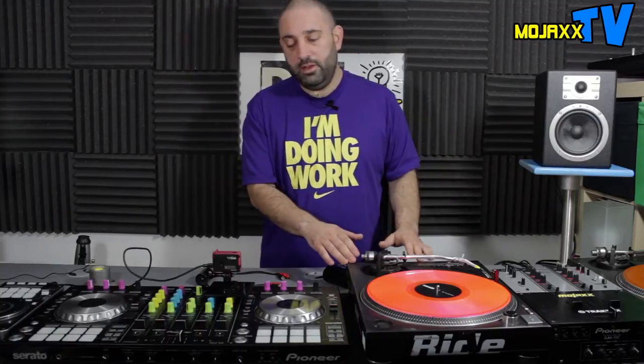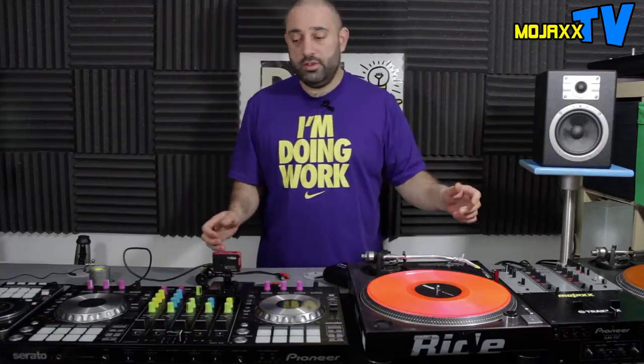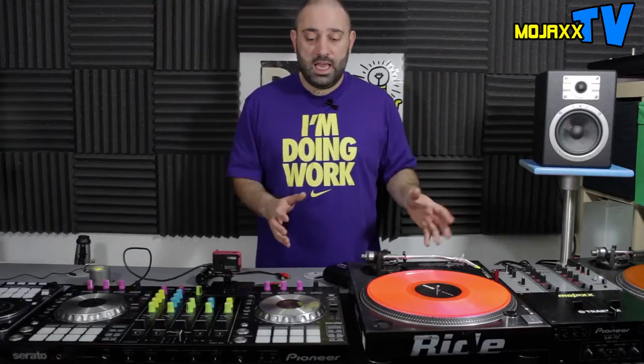Now, just to explain briefly, if you don't know what a ground loop is, I'm not an electrical engineer, so this is just kind of what I've picked up as a DJ, all right? I'm not a technician, it's not my thing, but I need to know something about these things so I can solve them at my gigs. So a ground loop is basically where you've got a piece of electrical equipment and it's feeding through, say, a sound system and through the mains and so on. And what you get is basically it's got two paths to earth.